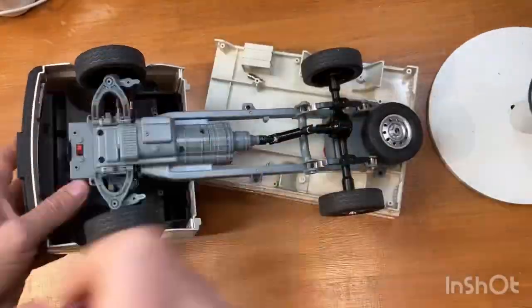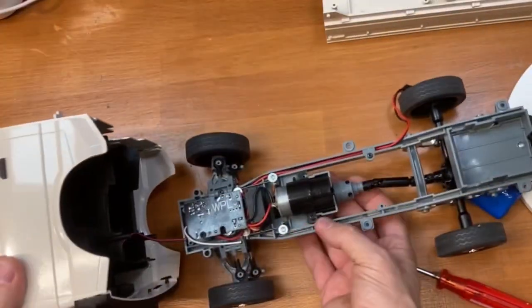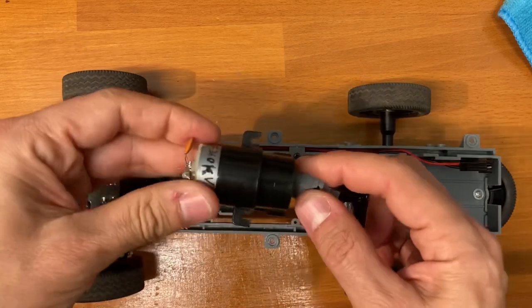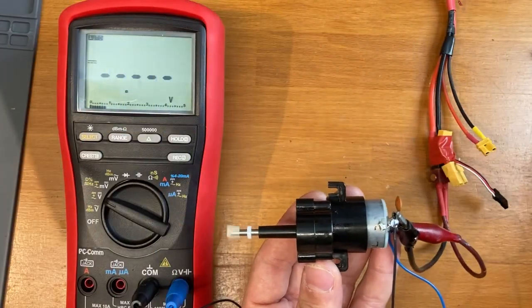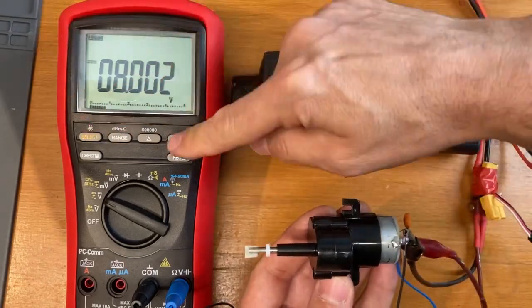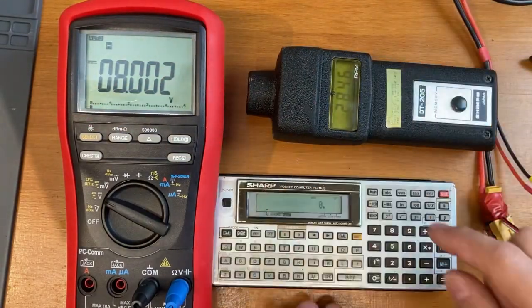Let's start by analyzing and comparing the original gearbox. The equivalent gearbox plus motor KV is 350, so if you take a 1000 KV brushless motor, you will be three times faster, for instance.